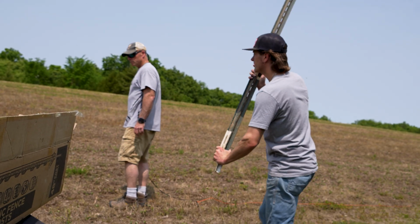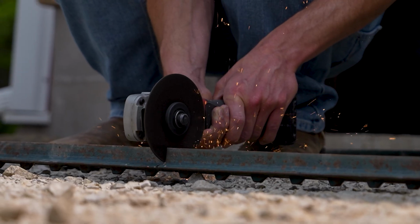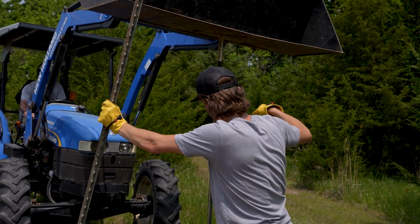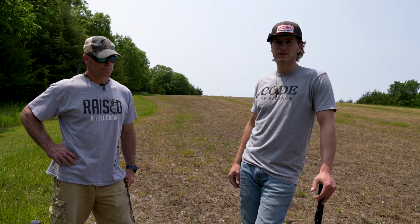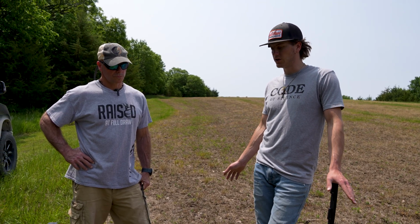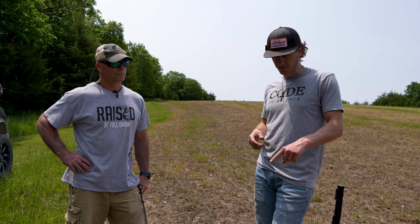Now, there's things you can do. If I would have taken more time to do this, I would have gone on Facebook Marketplace and tried to find some T-posts, things like that are cheap, and I can go pick some up. A lot of times people will sell their rolls of electric fence. Regardless though, this is new. We got some sales going on around here, so we got some good deals. We're doing a post every 20 to 30 feet. So we did just over 25 plastic posts. Anything where there's gonna be a tension point or a corner is where we're putting T-posts. That's why we're doing some of this pretty much going straight, because I don't wanna have more and more T-posts. So that's one way to cut costs, because T-posts are much more expensive.